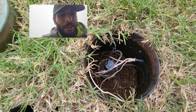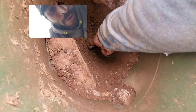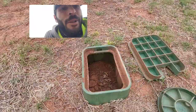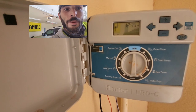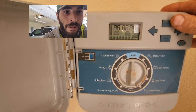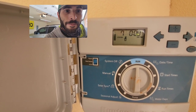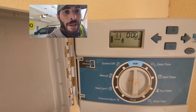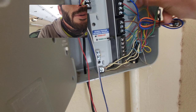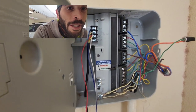I'm going to go back to the front yard, turn the water back on, and then test it from the controller. I'm turning the water back on with an easy quarter turn, slowly so it doesn't damage any of the dry lines. Back at the controller, we're going to do the same test — hold down the left, right, up, and down buttons all at the same time, then hit the plus button. Before, it gave us an error on zone 5. Now we're getting an error on zone 9 as expected with the add-a-zone, but nothing on zone 5.